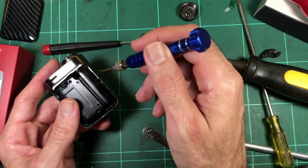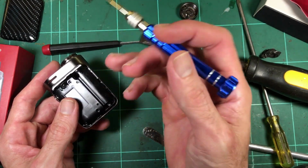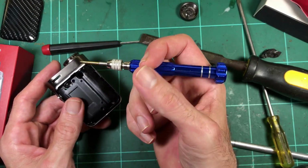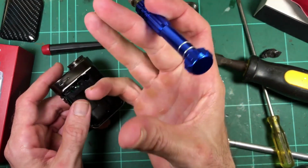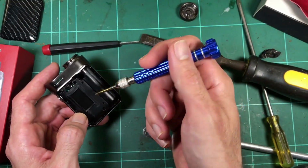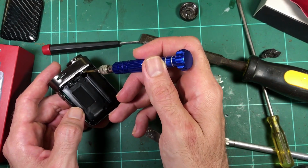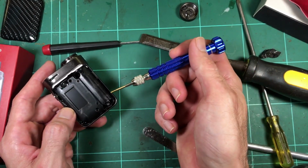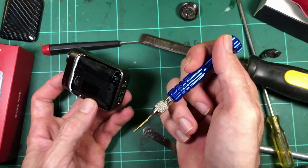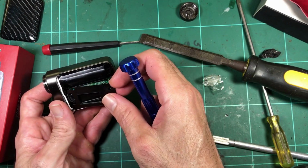For the battery vents, basically we're trying to prevent a build-up of pressure in the device. We don't want it completely tightly enclosed, because that just makes it an even more violent explosion if a battery were to vent or go into runaway or something catastrophic like that. So maybe that's a venting thing, because there's no gap down the bottom there, and those vents aren't really going to do anything because they're not near the battery anyway.